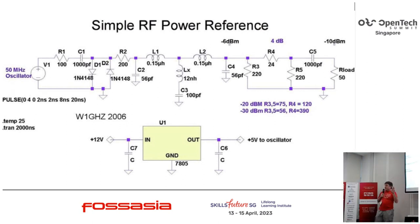All you need is a reasonably clean sine wave. So no PLL, just a crystal. Jam a pair of back-to-back diodes across it. This revolting procedure has two effects. One is you now have a substantial energy component at double the frequency. The other is that the peak is not going anywhere.